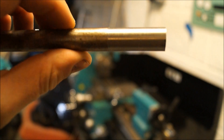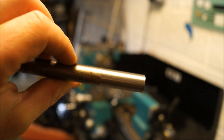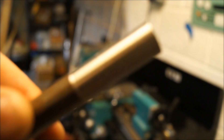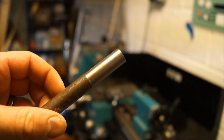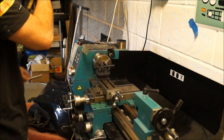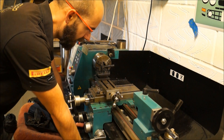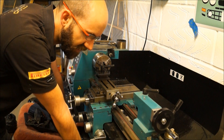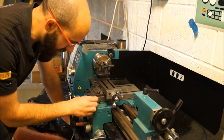Look at that — what do you reckon? It's not bad. That's just some mild steel but I'm very pleased. I didn't put any lash control in there at all in the end. The thread ended up cutting so nicely that as I say there's no play. I've tightened up the gibs so that everything is moving nicely and it's all clean.